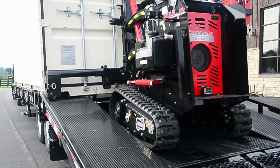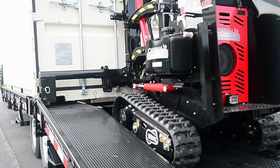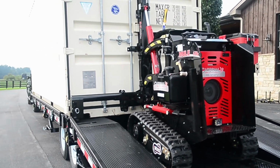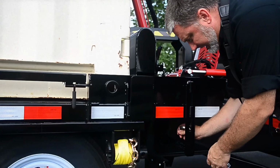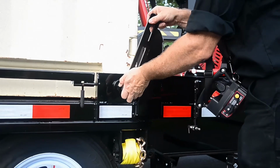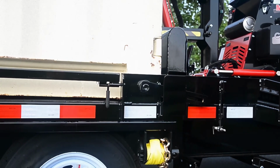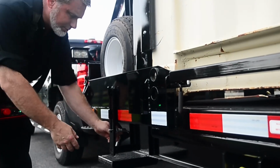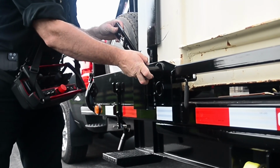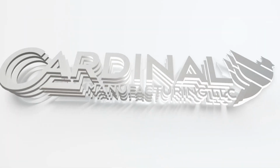The front of the trailer serves as a stop to position the container correctly onto the trailer. Lower the container onto the trailer and secure by inserting the pins through the trailer sidewall and into the container corner blocks. Aligning the holes on the trailer and container is achieved by using the remote control to inch the container into exact position. Thank you for watching.